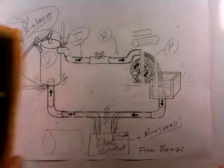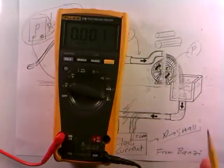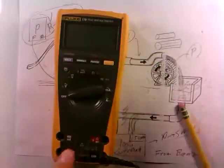There are a lot of nuances and differences here, but the water analogy helps very much. Just remember, these meters are not automatic — you have to tell them exactly what to do. You have to get your jack into the right spot and your dial set to the right setting, or your measurement is just going to be nonsense.